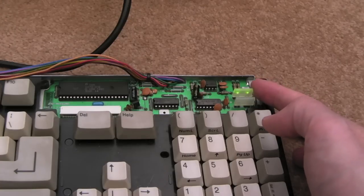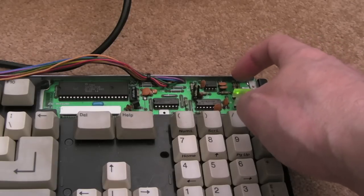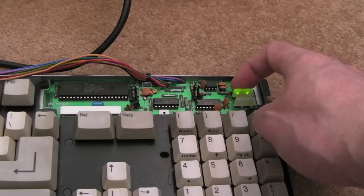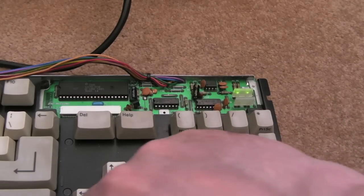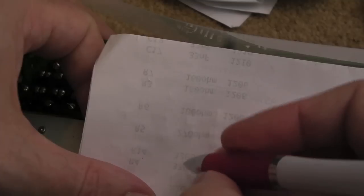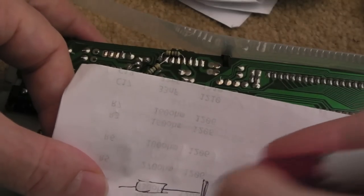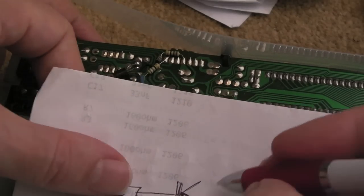If I switch this on — there you go, you can see it's illuminated. It's not very bright as I say, you can see it more clearly from there, but it's always been like this. I'm going to have a think about driving this LED using the transistor we removed from here, another 68-ohm resistor, and probably something like a 4K7 resistor on the input — just like the original circuit has for driving this.